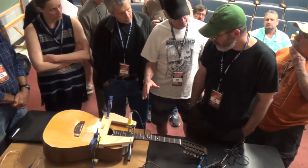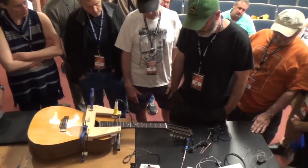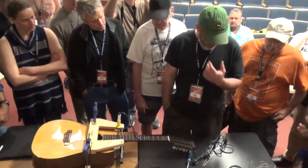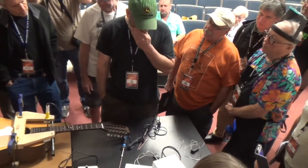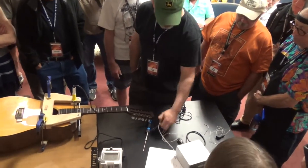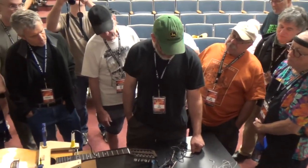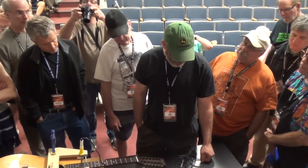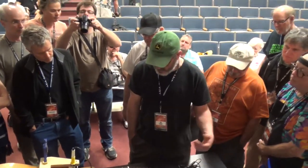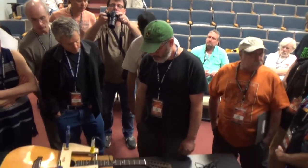Yeah, use an infrared light, with an aluminum reflector. Yep, Home Depot 250 watt infrared. I used blankets for a long time. I burned up my fingerboard extension once when the thermocouple slipped out from underneath it. I had a bunch of issues with blankets, and I just went back to lights recently because blankets are expensive to replace. These blankets are $100 a pop. It gets expensive after a little while.